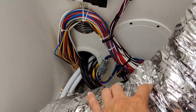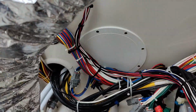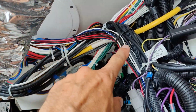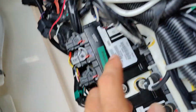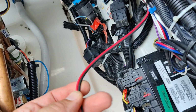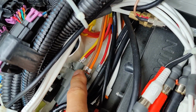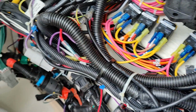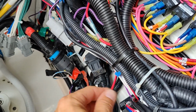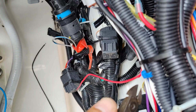Well, I was wrong about something. Here's our control box. We got our wiring harness here. Follow the lead here so it can fold in the dash. Goes all the way to our connectors here. We got our connector here for our power. And these two wires actually are NMEA in and out. They don't go to anything because we got power supply from our main right here. So we don't need extra power for the dash. So let me cut these. We don't need them, we'll just leave them here in case they ever want to use them, but this thing's already hooked up to NMEA.